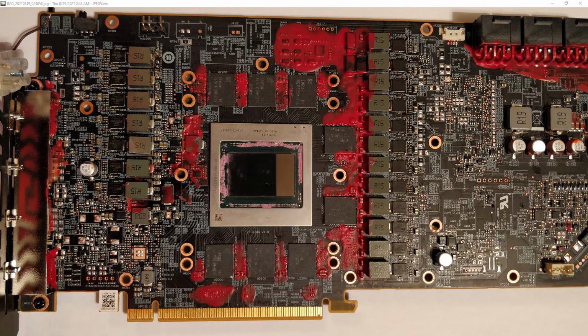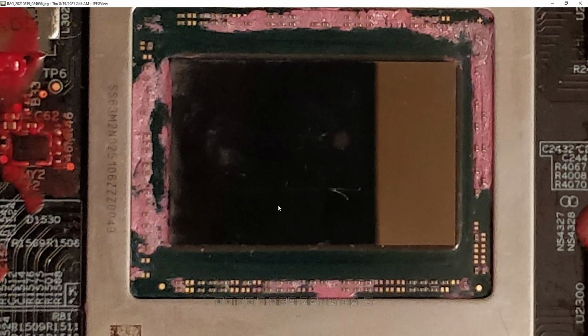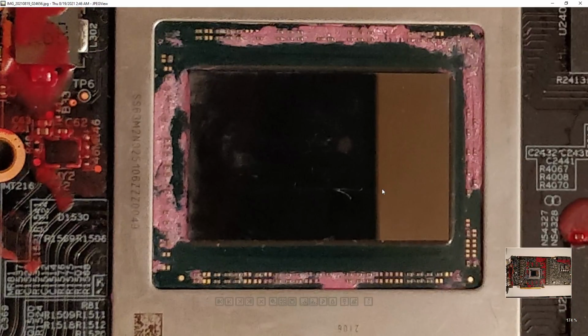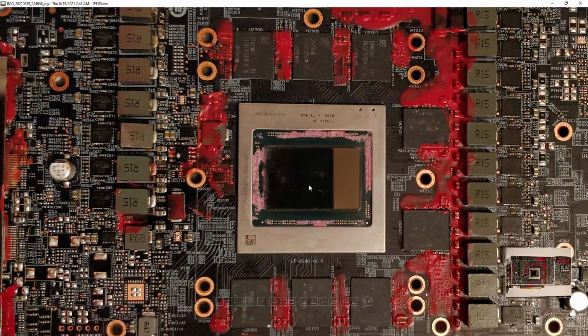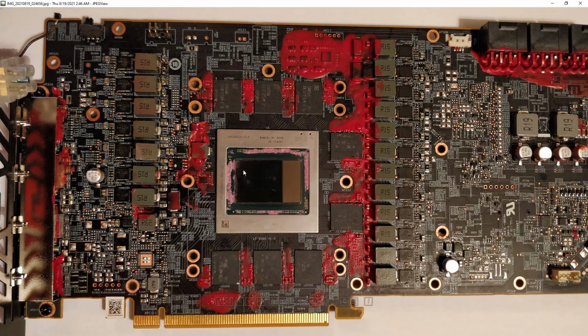And I guess I have a really clear visual example of why you don't want your VRM to fail, because this can happen. Usually you won't get the crack. You'll usually get microscopic level damage, not stuff that you can see with your eyes. This is sort of the worst case scenario for high side MOSFET failure. It just destroys the chip. Quite thoroughly destroys the chip, as mine is literally cracked in this case.